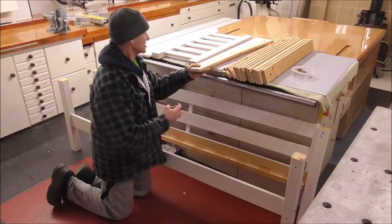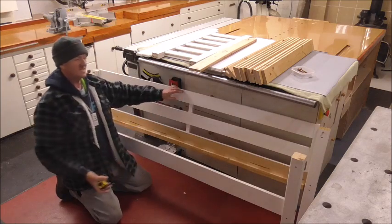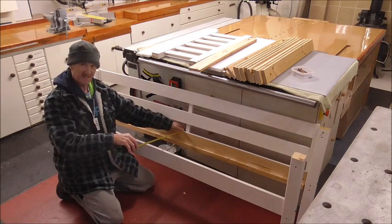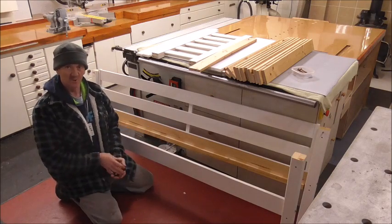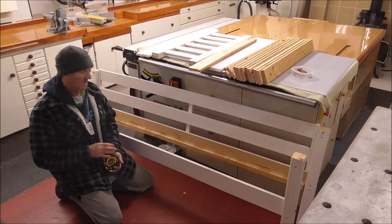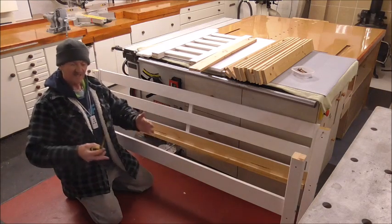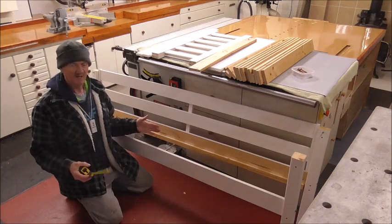Right, so once we've adjusted the width of the bed, cutting that down, we then need, because this is going to go up in the air standing on a wardrobe, to work out what the depth of the wardrobe is going to be in relation to this, so we know what we've got left. Remembering all this is getting done in the workshop, with a few measurements in his head, we'll go back there, everything needs to fit. So a lot of thought about sizes and measurements. The shelving unit behind the wardrobe needs to, added to the wardrobe, equal the size of the bed with the frame. So remember to keep that calculation in your head.